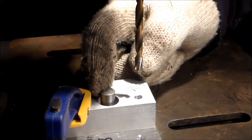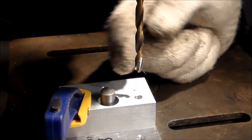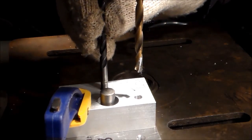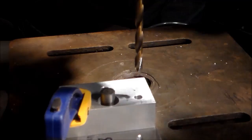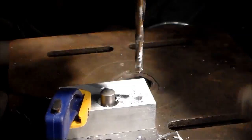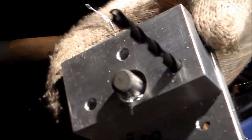I've got that drill bit in the bore pinning these two parts together. I'm going to drill my first hole and I've got an extra quarter-inch drill bit that I'll put in it as a locator to keep everything aligned that way. I've got that part pinned in two places — it's not going to move now. I'll go ahead and drill the other holes.